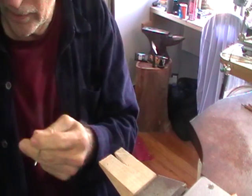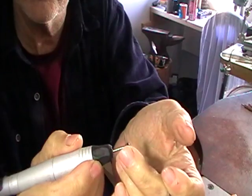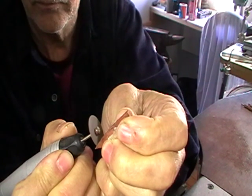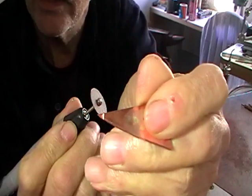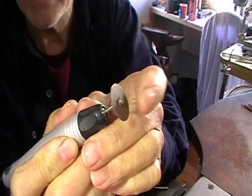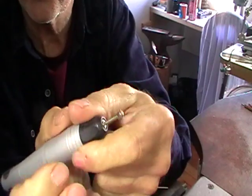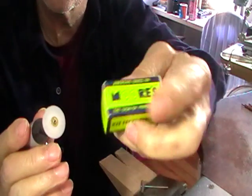The next thing is another screw mandrel, only with a cutoff wheel, and this is a carbide thin wheel. It's very brittle, but it does work really well for cutting a thin line. Now, be very careful with this, because when using anything that spins, have safety glasses on, but these in particular, because you can see how brittle they are. And when that flies, I almost guarantee that it will hit you. Safety glasses.